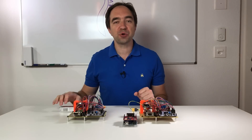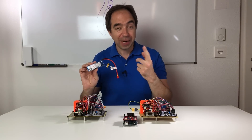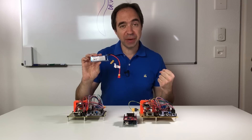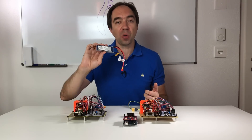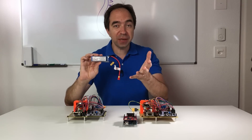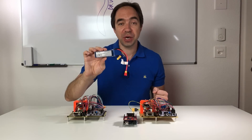To power up these controllers we are going to use a battery. Because when the motor accelerates the controller takes energy from the battery, and when the motor decelerates it puts this energy back to the battery. So our power source should be able to both give and receive energy, and a battery is perfect for this — it can discharge and charge.